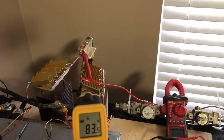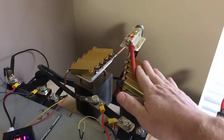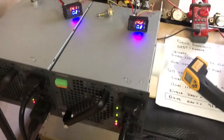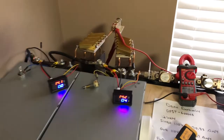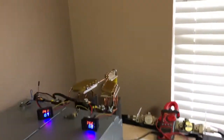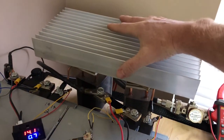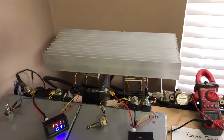Temperature is now at 82 to 83 degrees — barely warm to the touch. If I'm transmitting on this for a while it will get warmer, but I have a plan for that: I'm going to drill the resistors into a heat sink. I've got a large heat sink right here — that'll take care of it.